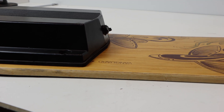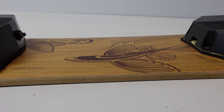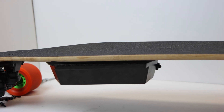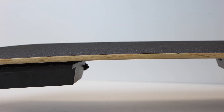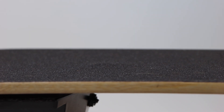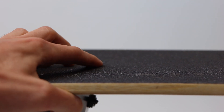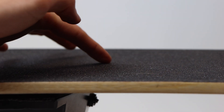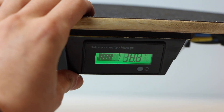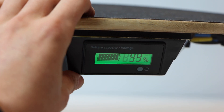For those who didn't watch our first DIY Boosted Board tutorial: the front battery enclosure connects to the rear ESC enclosure through wires that run through a channel we cut with a router in the top of the Vanguard, then through holes into the bottom where they connect to the battery and ESC. You can see a small bump under the grip tape where these wires pass through. There's also a percentage indicator inside the ESC enclosure, a great feature so you always know how much battery is left.